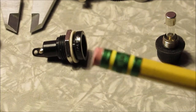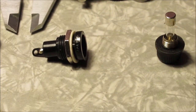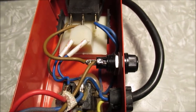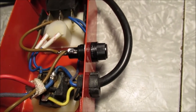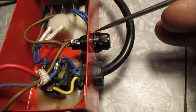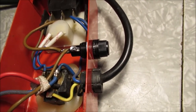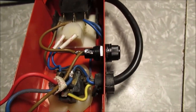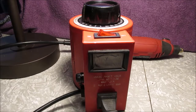Look for the picture of cleaning the copper on there - that's what I use the pencil eraser for. Okay, the soldering is done. We had to make the hole a little bit bigger, and we did take a picture of the fuse holder. There's a little plastic tang on there - we had to file a notch to keep it from spinning. Just a little bit of work, blew out all the metal dust, and we're done. Going to put it back together and see if it works.